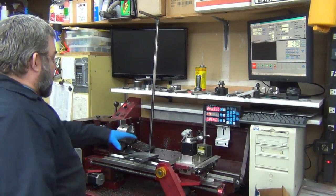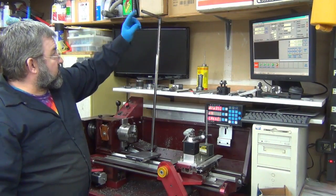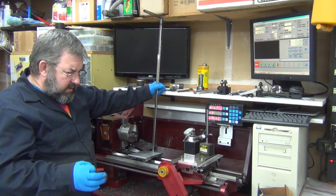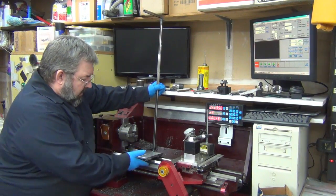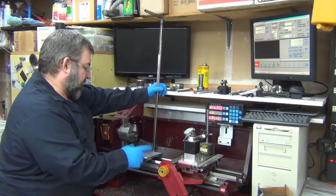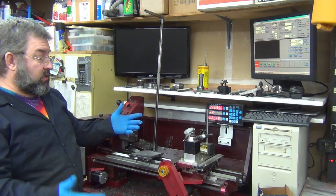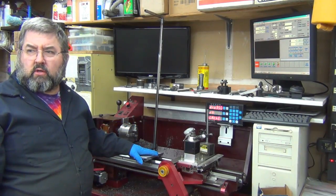I've been in the process of making this for checking the alignment on the lathe - might be kind of hard to make out on video, but basically it's just some square tubing tacked together. After watching Dale Derry, I realized he used a plate that was flat on the bottom, which makes it a whole lot easier to put shim stock underneath to check it. My contact points with the angular stuff aren't as easy as what he was showing.